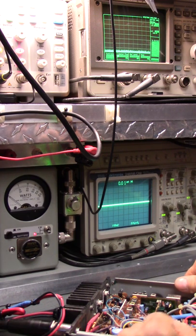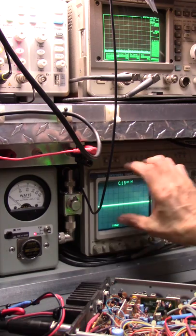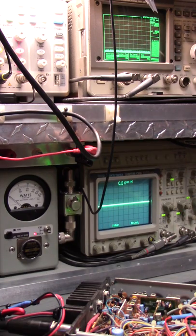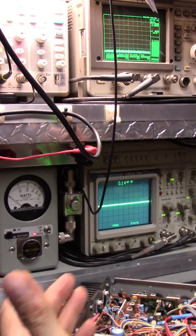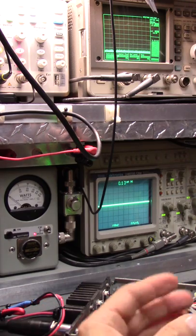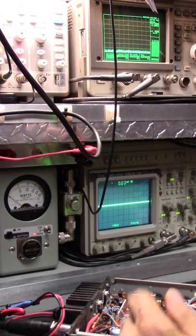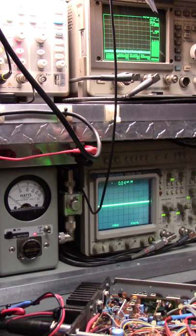It's the cleanest of all, but it's the least efficient of all. It takes more power to do that. Just because you've seen this doesn't really mean that it's that low in modulation. How it really sounds in a lot of other radios is basically the distance apart that you are from the receiving antenna and the AGC and how it's receiving it. So there's a lot of variables involved in how it actually sounds.